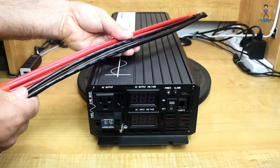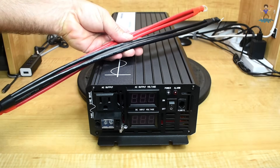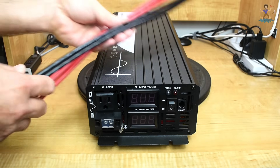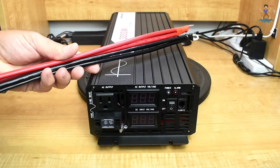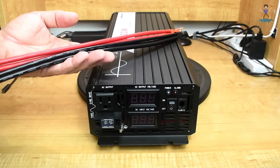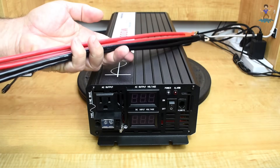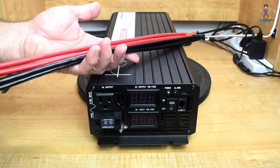The one thing about these wires is they appear to be number 6 gauge. I would have liked to have seen number 4. If they were number 4, three of these together would have no problem supplying up to 300 amps to this inverter. So these are a little undersized — they'll probably handle 220 amps fine, but above that they'll get very warm. If this were a 24 volt model, these would be fine because the current would be half the amount.